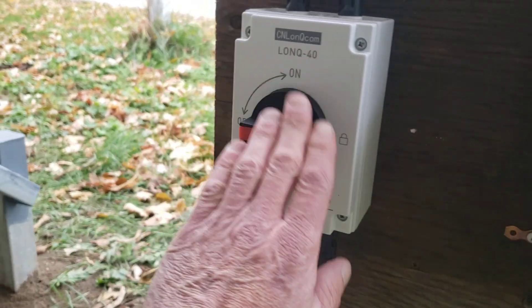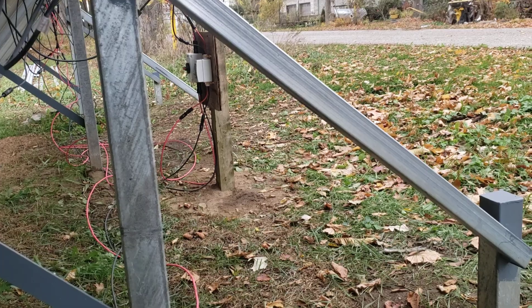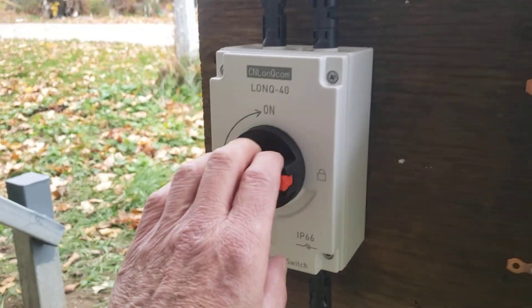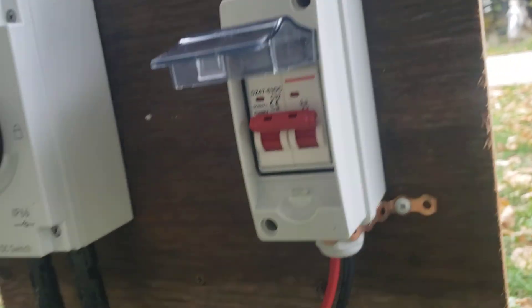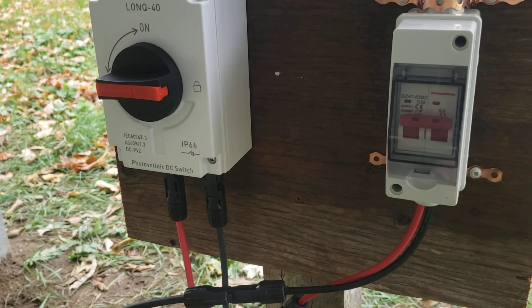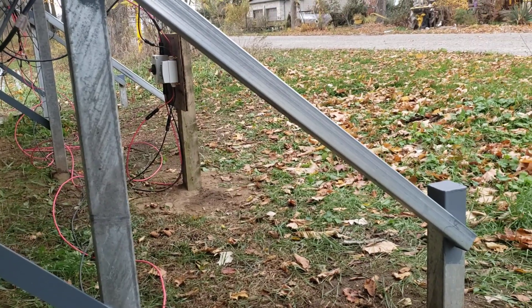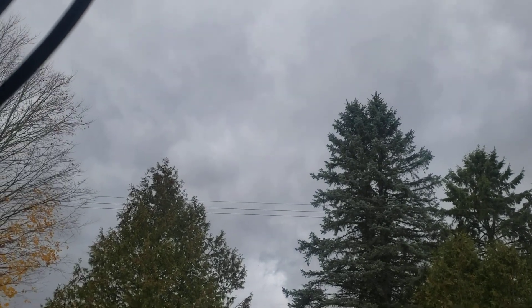What's going on is this unit, and it's a mirror image over there — exactly the same setup. Eight panels on the far side feed into that side. If this disconnect is off and this one is on — which it is right now — you can see when you look at those 16 panels strung to both heat pumps: on a cloudy crappy day like today there's just not enough juice to turn them on.